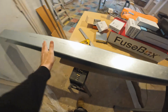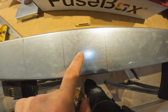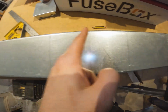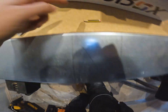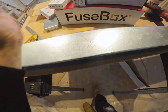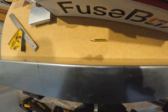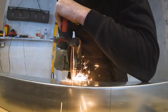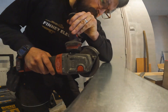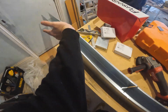Alright, so what we're going to do is get this metal tray chopped. We've measured from there to where we want it - it's going to flip upwards. We take this section out. We've done 100mm that way, 100mm that way. We're going to do a little slice down the back, slice down here, a little V here, and then take out just this section. Then we've got to flap it up - this will become a little flap which will slot under here, and we can get two little bolts which will hold it all together nicely.